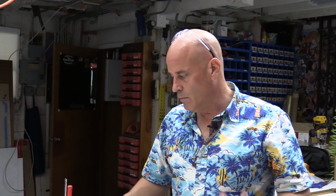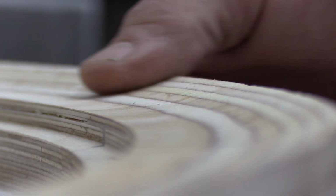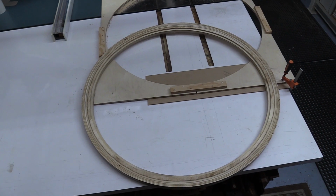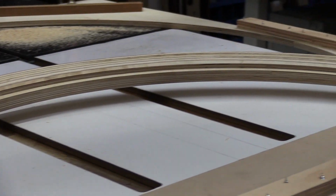You know, because of the grain going across the blade, actually going opposite of the way the blade's going, that's what's gonna happen as you make a circle in plywood. You have some cuts that are going exactly with the grain. And on the top edge, the furthest point out gets really thin with the cross grain on that layer of the ply. So it chips off. So we're gonna end up doing a little bit of filling with some Bondo. Fill it in a little bit and then sand the whole thing really nice and smooth, and then we can start veneering on top of that.